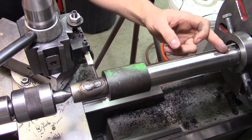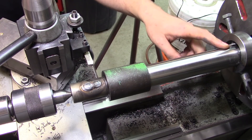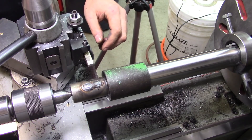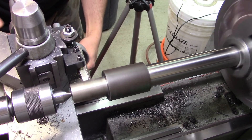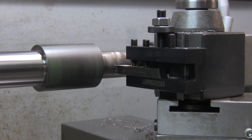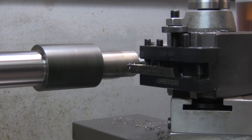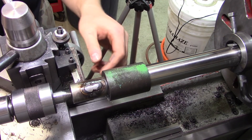We're looking at sizing and a little bit of armchair engineering — we're going to take two inches off this end here. The reason being we don't want that much stick-out. We'll take two inches off here and then we'll do our cross drilling. We still have to match up the cross drilling with the other piece, but anyway we're going to cut this down. I want to be very careful here because it's an interrupted cut — that's partly why I'm using the high speed steel tool. I'm going to keep carving away at this and I'll bring you back when we're a little closer.